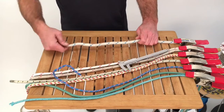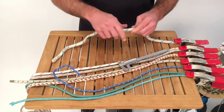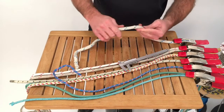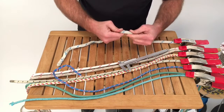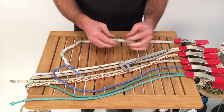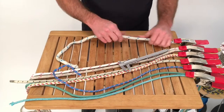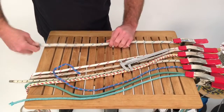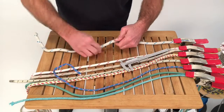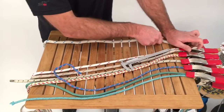Okay, last line. I'm going to guess this is a double braid polyester. It feels soft. It's spongy. I can tell it's got some damage to the fibers because they feel chalky. I feel like the whole thing is just kind of nested up, and it just feels fat to me. I'm going to be challenged to, oh, and I can feel all those waves down here, so I want to stay away from all that damaged area. I'll be measuring up here.